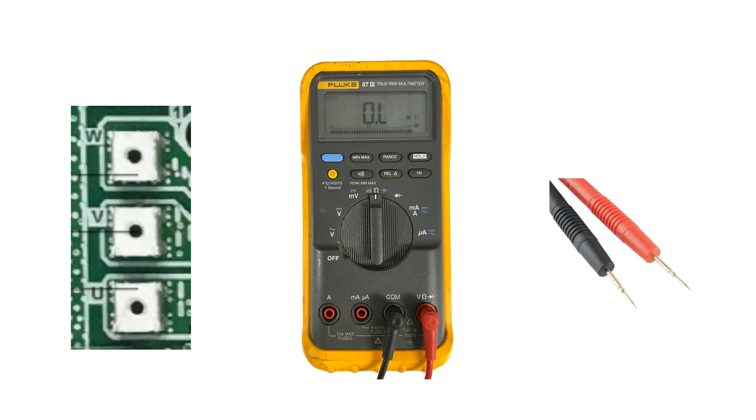Power off and wait at least 3 minutes before powering on. Check if the unit can run at least 1 hour. If it can, then check the refrigerant charge and adjust. If it can't, and the error code is still happening, check the winding resistance.